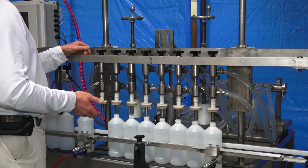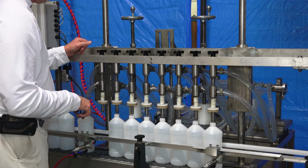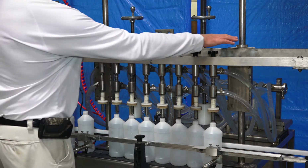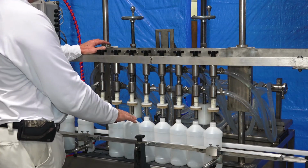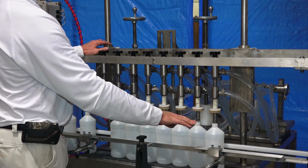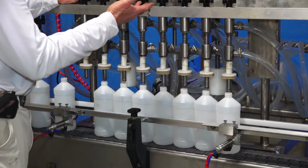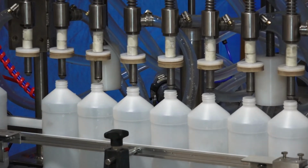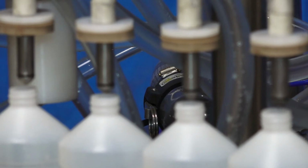If we need to raise it up, we're putting too much pressure, we'll start to crush our bottles, we can crank them down some. Now the collars on the top limit the travel up. You want probably anywhere from 3/8 to ½ inch above your containers in the up position, just so your bottles have clearance and none of the nozzles come in contact for conveying them in and out.